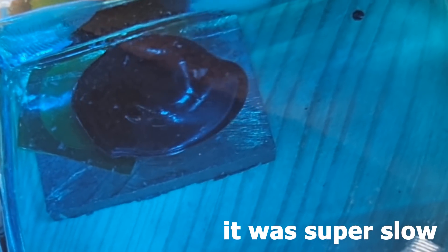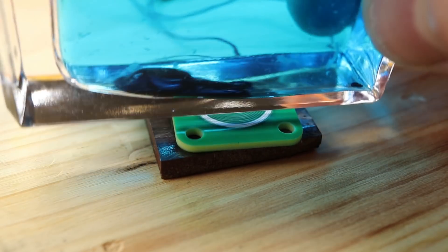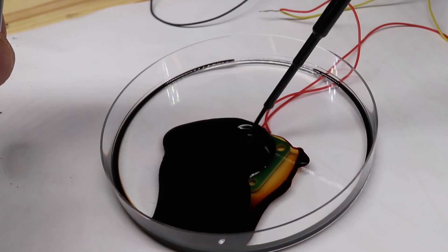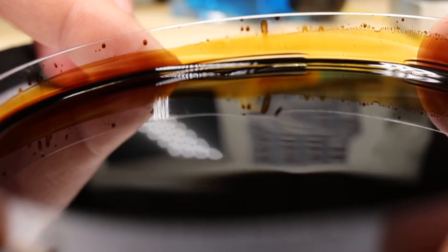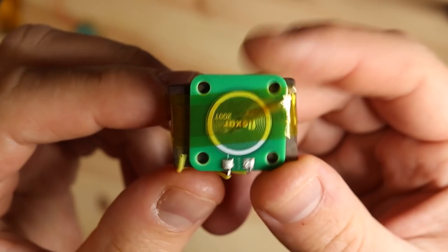When it comes to ferrofluid control, the 4-layer coil didn't work that well — the best result I was getting was with the 12-layer coil. But the ferrofluid in the jar wasn't very liquidy, and the glass also had some thicker areas. So I ordered some better quality ferrofluid and tested it in a thin Petri dish. My new PCB electromagnet managed to attract a small bubble of ferrofluid. Then Simi suggested something that changed everything: biasing the core with a permanent magnet. I'm not sure if this is considered cheating, but it worked very well with my setup.